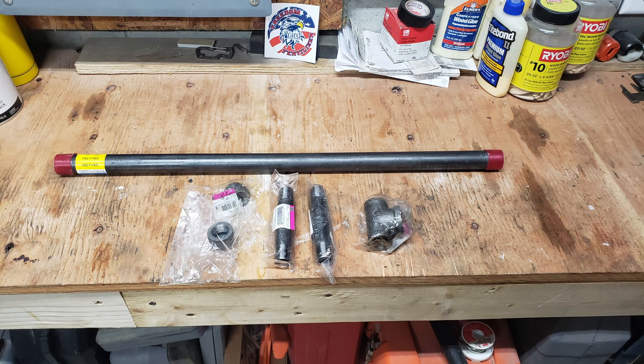Now in order to make one of these, it's going to take you about 20 minutes and it's going to cost you probably under $20. I picked up all my parts at a Lowe's or a Home Depot, or you can get them at any local hardware store. It's standard pipe parts. It's basically a three-quarter inch by two-foot piece of black iron pipe threaded at both ends, a T which is three-quarter by half by half, two half-inch by four-and-a-half nipples threaded both ends, and then two half-inch caps. It'll take about five minutes to assemble and another 15–20 minutes to make the cut for the notch to extract the soil sample. So let's get started.